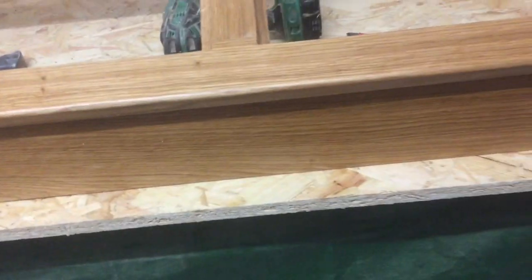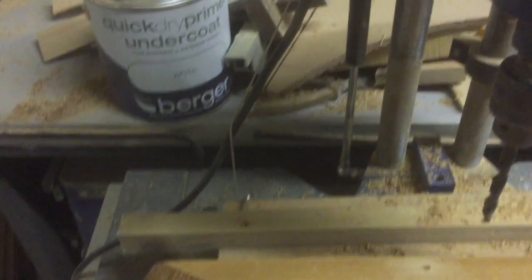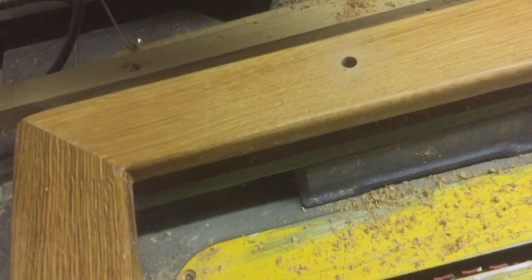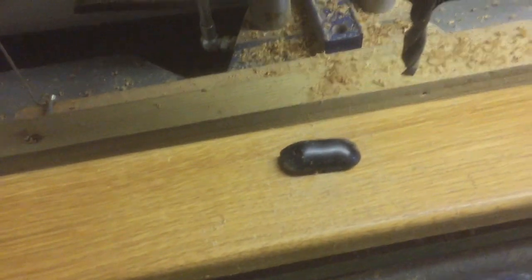I'm going to get the sash on the other side, then give it a light rub down and one more coat of sealer oil, and once that's gone off I can put the glass in. Good morning — just a last little job on the frames. I've been drilling holes, two in each frame of the arch tops, going right through to that groove along the bottom. These are drain holes: where the window opens inwards, any water that hits the window runs down into the frame and lets itself out through the drain hole.